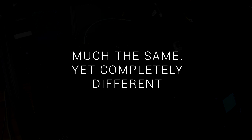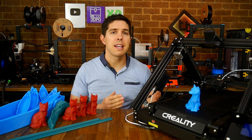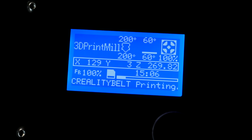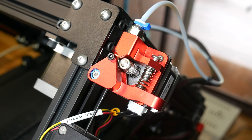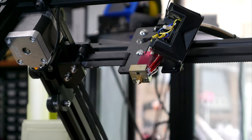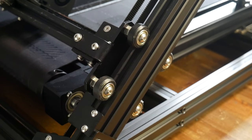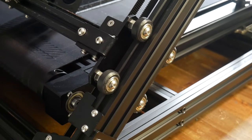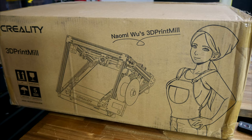This 3D printer is much the same, but completely different. The reason Creality is able to make this printer so much cheaper than previous models is that they can build on their existing products. The LCD display is exactly the same as an Ender 3, the dual-drive Bondtech extruder is just like from a CR10S Pro or CR10 Max, the filament run-out sensor is the same as on other Creality printers, and the hot end is identical to an Ender 3 but with twin 4010 blower fans for improved part cooling. The frame and motion system is based on V-slot extrusion and V-rollers. From the moment you unbox the printer, your experience will be familiar.